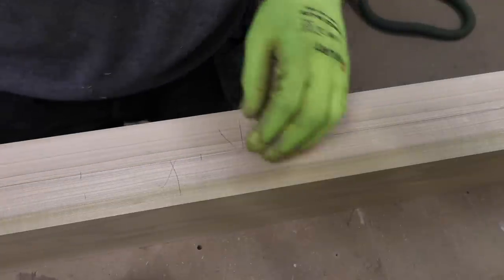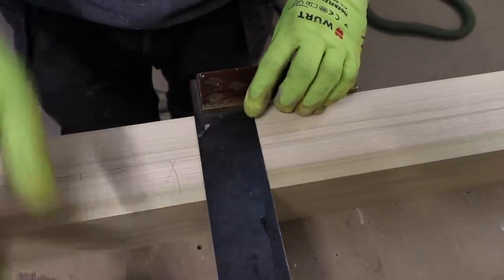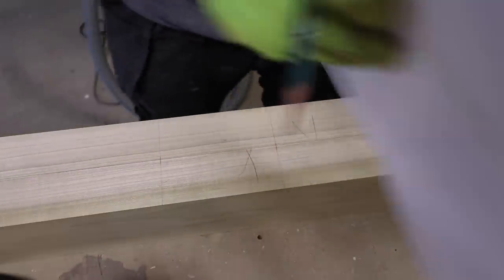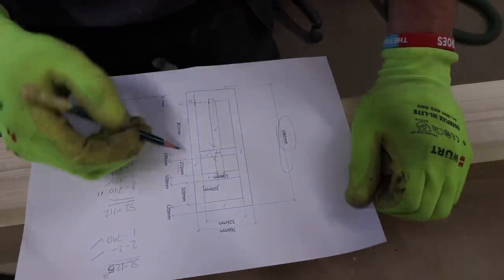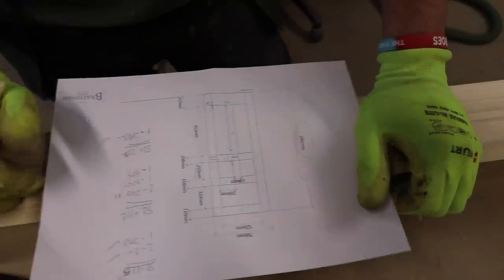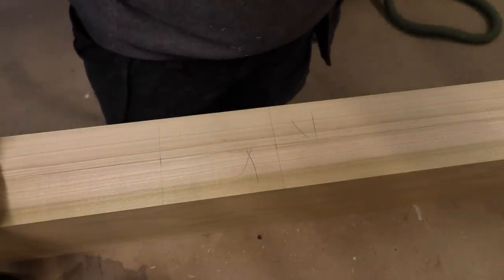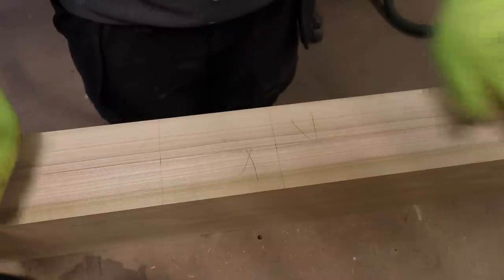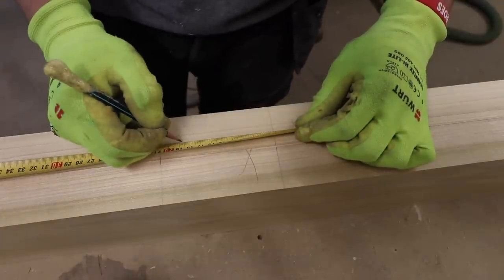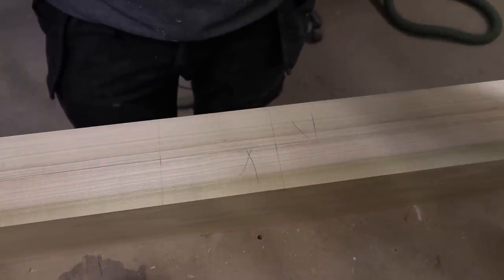So, like everything, starting with the positioning, and then we're breaking the joint down once we've got it in position. Now with this type of rail, you could either reduce the tenon down to something a bit smaller, but by the time you've got two setbacks in there, what are we left with? That'd be 88 mil. It's probably a tiny bit too big, isn't it? 88 mil, is that too big for a tenon? It's taking quite a lot out of the door.